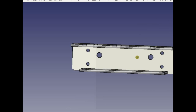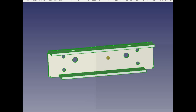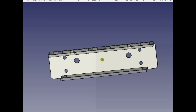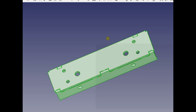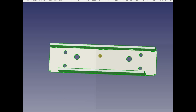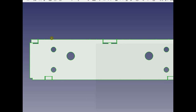Now this gets into some of the FreeCAD issues that we talked about before about reverse engineering. Unfortunately, this is not a FreeCAD native object. This was generated in LibreCAD by Rob Bedingfield, and he exported it into STEP format, and that's why we can import it into FreeCAD, but there are no underlying sketches. In other words, you can't change this. Sorry, you've got to redo it. So what's the procedure there? You've got to redo it. You can go onto one of the faces, and the only thing you can do is trace it out, but you have to do exactly as it is here.